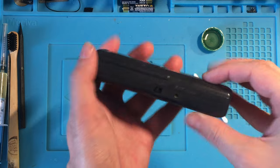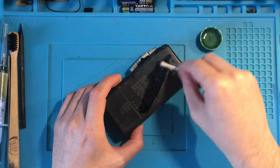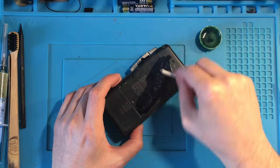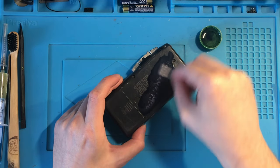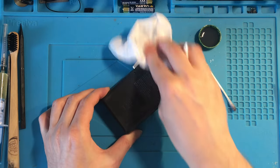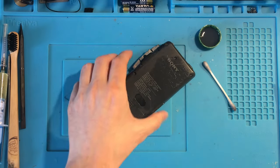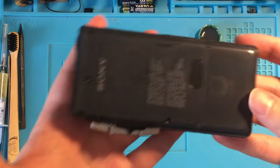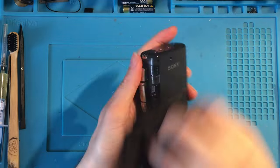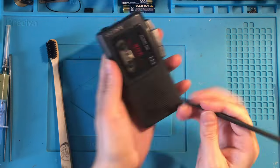After closing it, I wanted to clean the back from the ink used to cover that sort of identification number. For doing so, I used again the IPA alcohol. It took me a while, but eventually I was able to remove both ink and numbers. To complete the cleaning, I used a normal glass cleaner together with a medium toothbrush to eliminate any hidden trace of dust.